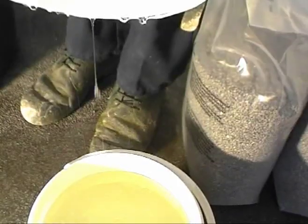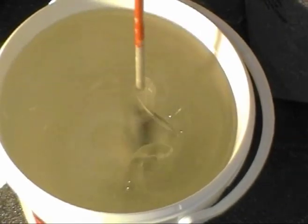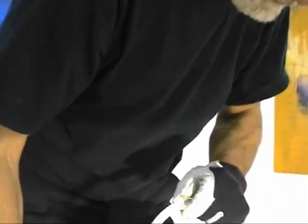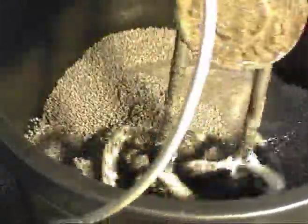Firstly, depending upon the size of the floor and the number of installers for the project, a mixture of 2 or 4 bags is prepared. The quartz granules are placed in a large mixing drum or concrete mixer. The 2-component binders are measured to accommodate the correct binder to quartz quantity, and the A and B components are mixed together for approximately 2 minutes. This mixture is then added to the quartz granules and thoroughly mixed.